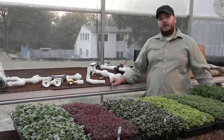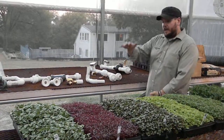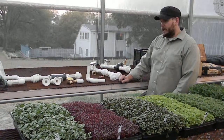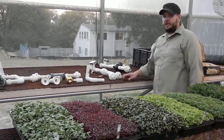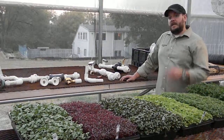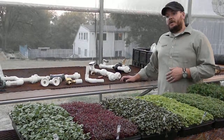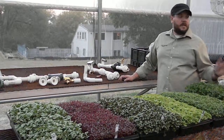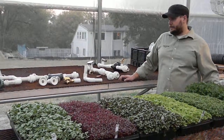In the far corner of the greenhouse, we actually have a short electric hot water heater that's 220 volts that can tuck nicely underneath the benches. It's about 30 gallons, and we think that's going to work great for our scenario. It does have 2 different heating elements. There are different ways to use the heater to get additional heat out of it, but we're going to be using it right as it came out of the box.